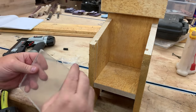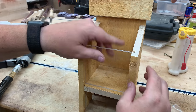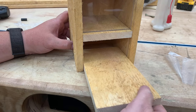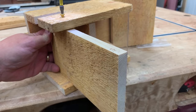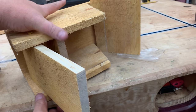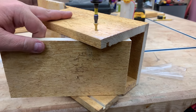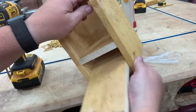Now we can finally take the plastic layer off of the acrylic — and now it's nice and clean. I don't generally bother cleaning up or sanding the edges because they're going to be hidden down in those dados. This piece here is going to be the lever, which allows the lid mechanism to go up and down. I've got screws pre-drilled into that lever and they correspond with holes set in the sides. I don't want to bury those screws — I want them out just a little bit because these screws are actually going to act as our pivot points. If I buried the screw in deeply, this board wouldn't spin very freely, but I do want it to go up and down fairly loosely.